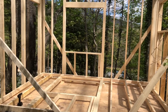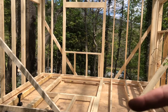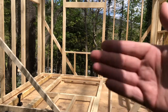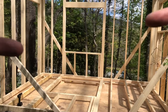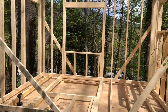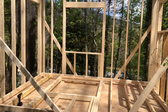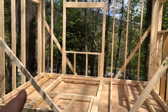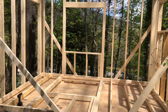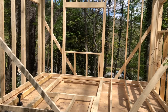We've been pretty much level and square through this whole job, and why stop now, right? But I unhooked the bottom screw over here just in case, because we are raising this wall up directly inside my two outside walls here, and just in case it's a little tight, this wall over here can flex a little since I have that undone. That's the first one. The second tip is I put little blocks right there underneath so that it can be picked up. And then the third one is over here. When I go to raise this, since I'm by myself, I'm not going to be able to jump down and just nail this right away. So I'm going to screw into this brace to the outside of that stud. So those are my tips. We'll see if they work. Let's raise the last wall.